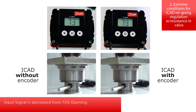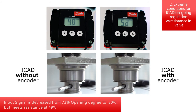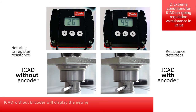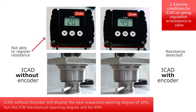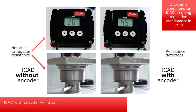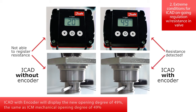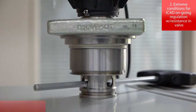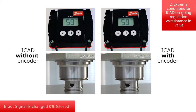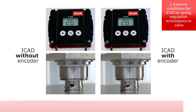Input signal is decreased from 73% opening degree to 20%, but meets resistance at 49%. ICAD without encoder will display the new requested opening degree of 20%, but the ICM mechanical opening degree will be 49%. ICAD with encoder will display the new opening degree of 49%, the same as the ICM mechanical opening degree of 49%.